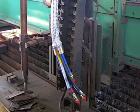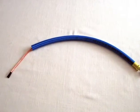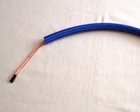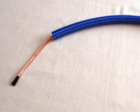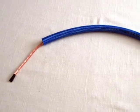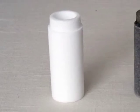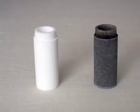The torch leads are part of both the coolant and electronic system of your plasma power supply. Contained inside the braided steel mesh protective covering are the torch coolant lines. Inside one of these lines is the copper lead taking power to the torch. The power lead is on the inside of the line taking coolant to the torch on the HPR power supplies, and on the return line on the HPR XD power supplies. It is this constant flow of coolant through the torch leads that causes the power lead to gradually deteriorate, destroying its ability to effectively transfer power to the torch. This can cause misfires and overall poor cut quality. A brand new coolant filter is pure white, while a used filter appears more charcoal colored.